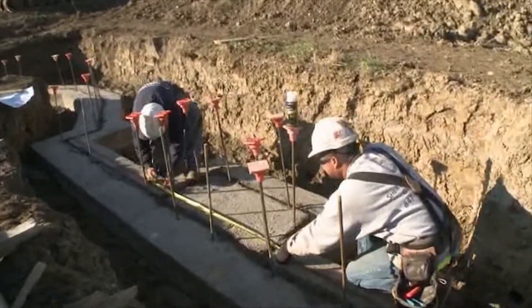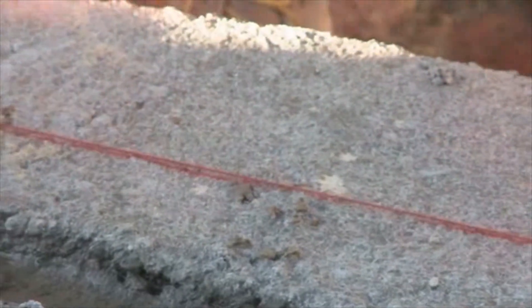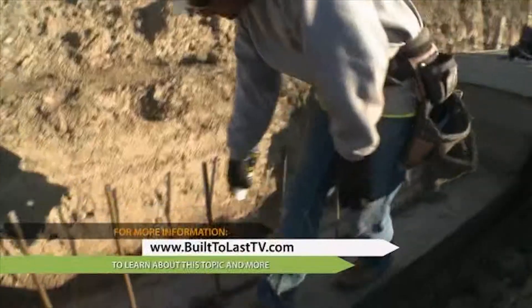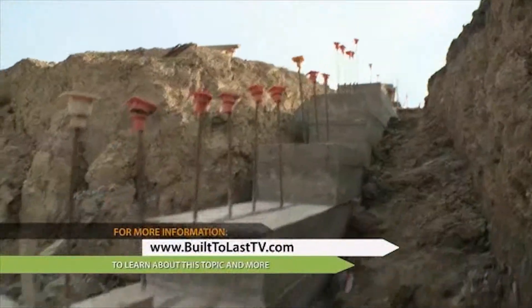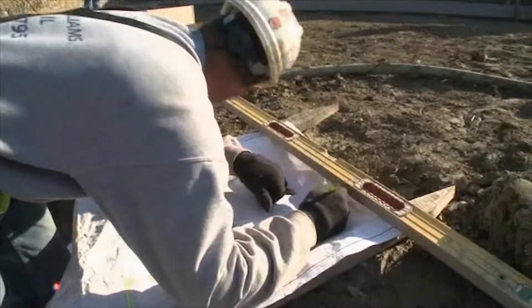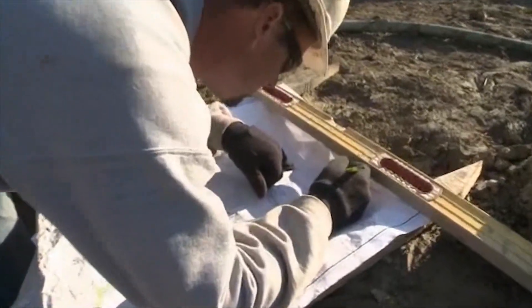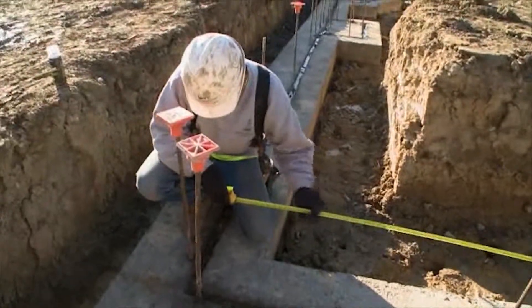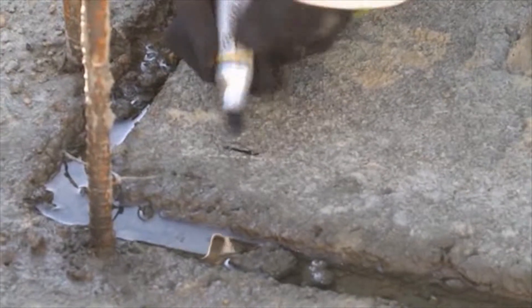My name is Jerry Herdlicka. I'm here as technical support for ARC's Insulated Concrete Forms. This morning, before we actually lay block, the gentlemen are snapping out red lines and then they put a sealer over the red line to keep the line so the weather doesn't take it away over time. So we always have that to reference. It's important that those measurements are taken correctly because there are building setback lines we have to hold. That's why our red lines are snapped and then sealed for the longevity of the project.